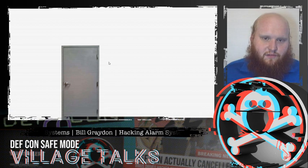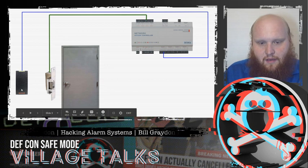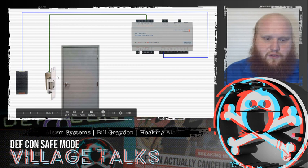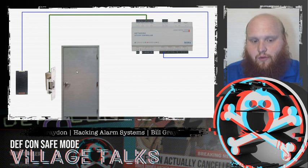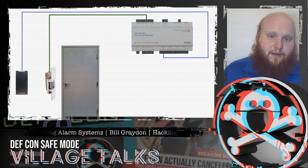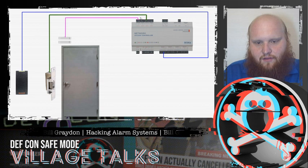What happens if we want to make this an access control door? At the bare minimum, we'll need to add some sort of credential reader, some sort of electronically controlled actuator that will lock and unlock the door, and some sort of controller that will determine if the credential is valid and, if so, unlock that door. At this point it's very easy to add sensing to detect anomalies such as brute force entry or bypassing, and that can be done quite cheaply by adding a magnetic reed switch.